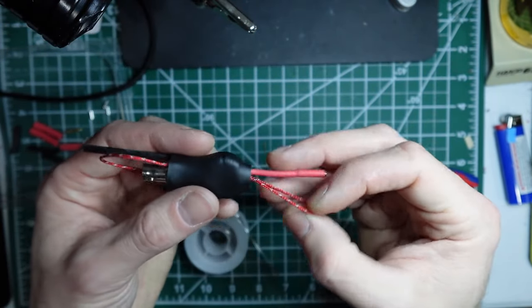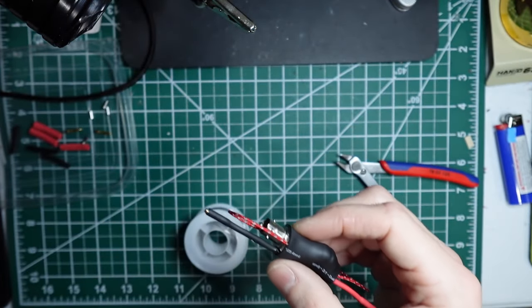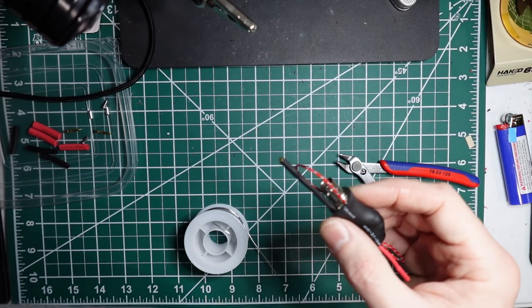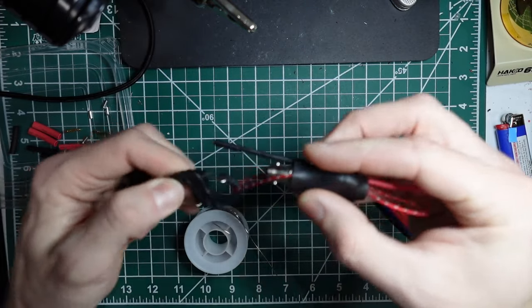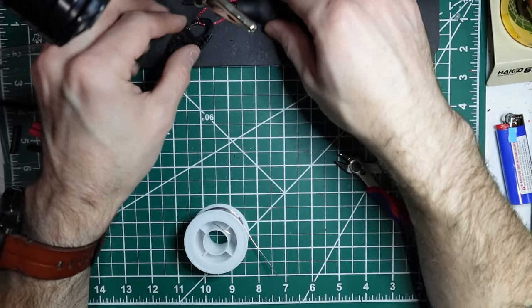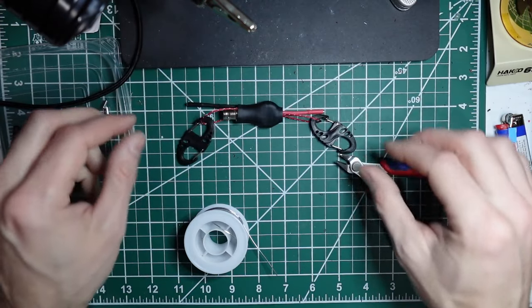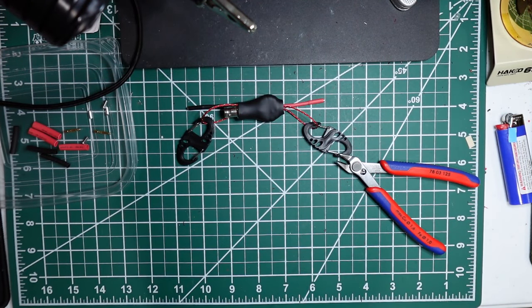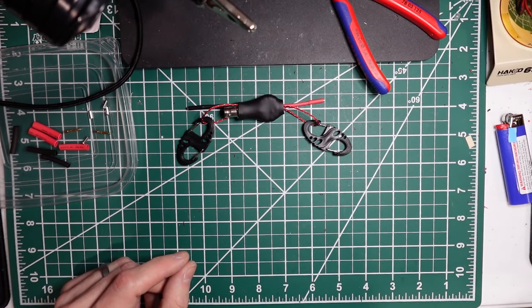Okay. And that's it for the actual winding itself. I'm going to throw the banana connectors on here and set those out in the kit. But there's the part that does the work. Just sit right there so you can see it. Now you're going to take the radiating wires, the counterpoise wire, and terminate the ends. So let me show you how to do that. I don't have them cut, so I'm going to cut them here real quick.